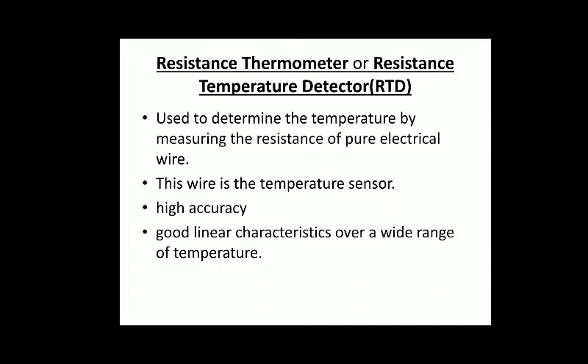The sensing element is a wire of platinum, nickel, or copper — we will see that later. These metals change their resistance for different temperatures, and for a certain range this temperature variation is linear. That is why we use it as a sensor, because if we attach a power supply to it, the variation in resistance means the voltage at the output side can also be varied.